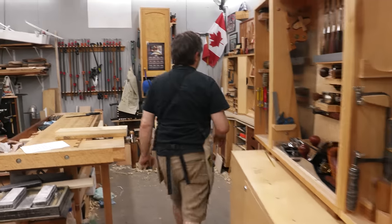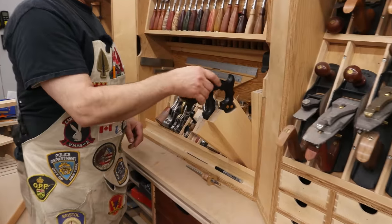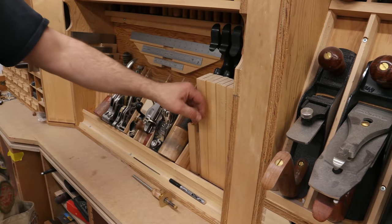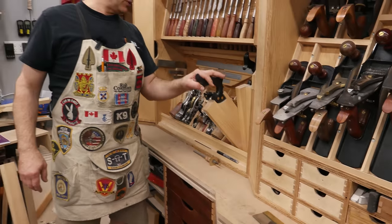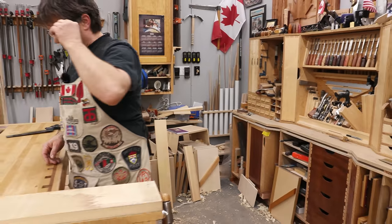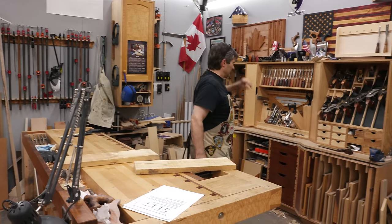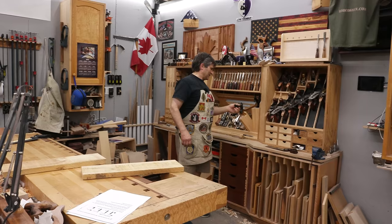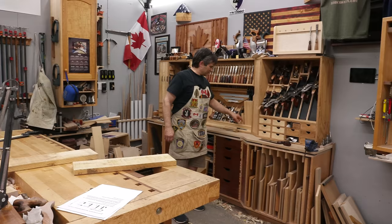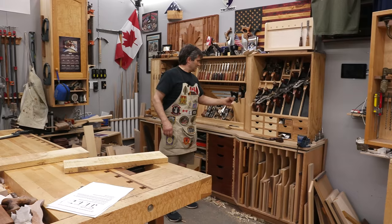We made the pockets a little bit bigger so they cover all of the blade, which keeps the blade from getting damaged and keeps me from skinning my knuckles. I'm going to walk you through the process of building one of these blocks and show you where the pivot pin needs to go. I'm going to make it out of poplar. You don't want to use a soft wood because of the abuse it takes with the saw sliding in and out, and you also need a fair bit of strength in the material for that pivot pin so it doesn't end up breaking the wood.